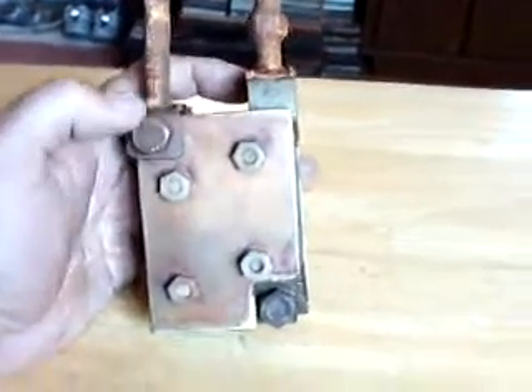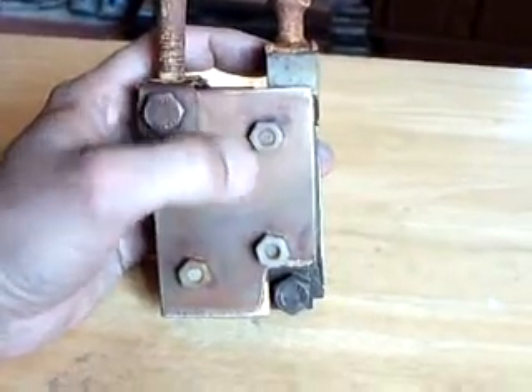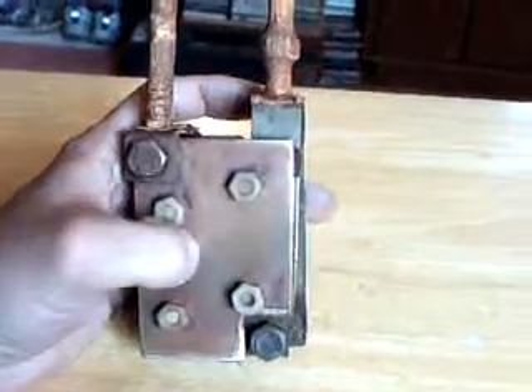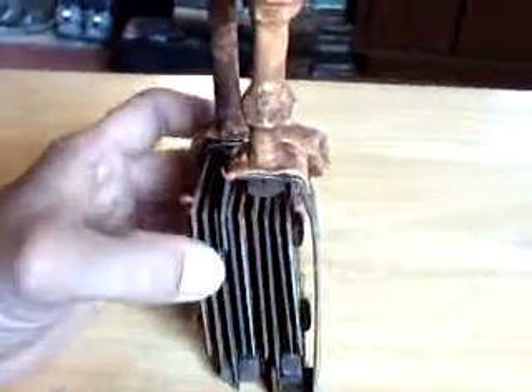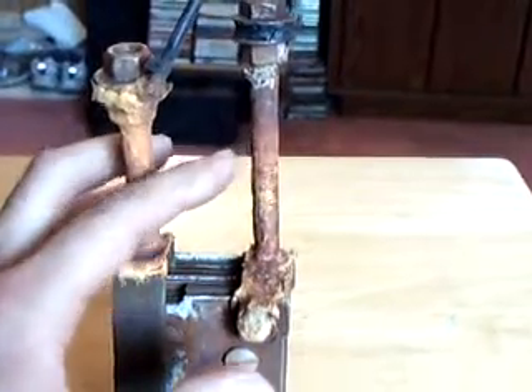This one here is pretty well toned up and everything. I've used sodium bicarbonate as an electrolyte and sodium hydroxide, but right now I'm currently using potassium hydroxide, which I find is the best and keeps everything clean. This here has been painted with some sort of electrical tape paint and keeps these terminals isolated.